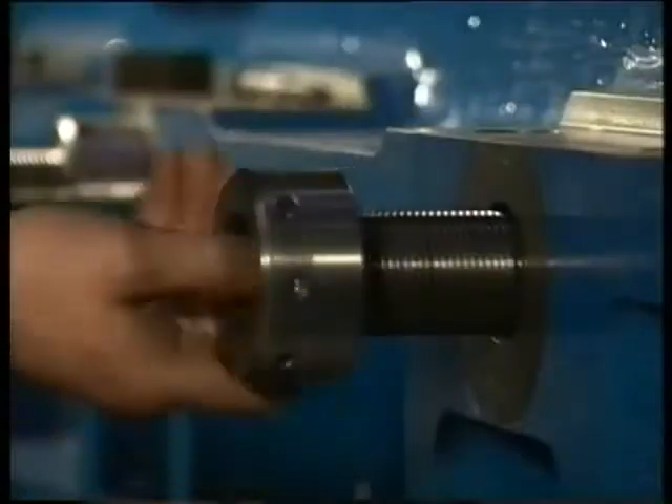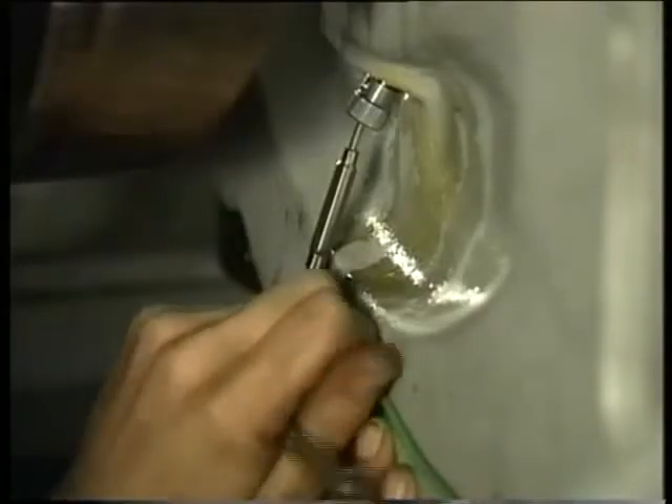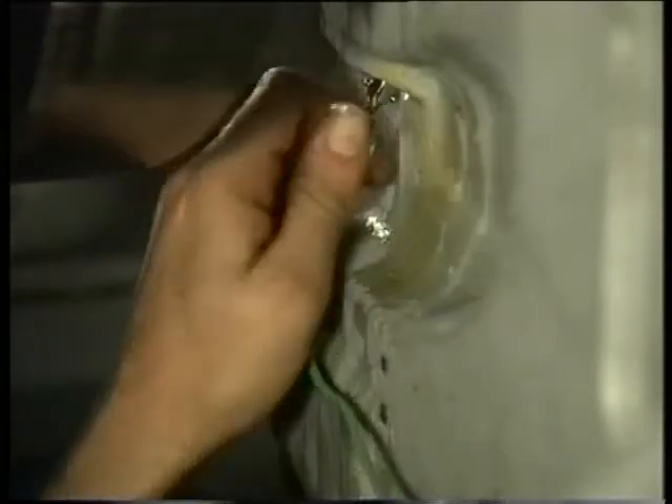Remove the nuts on either side. The engine is equipped with a bearing monitoring device. A sensor is fitted on each main bearing cap. The sensor can be detached by disconnecting the banjo union. This must be done before the main bearing cap is loosened by jacking.